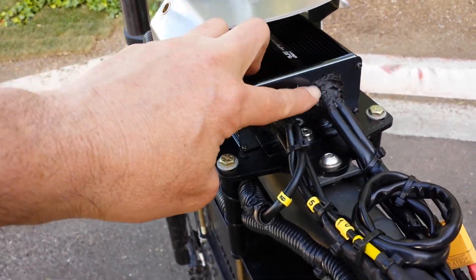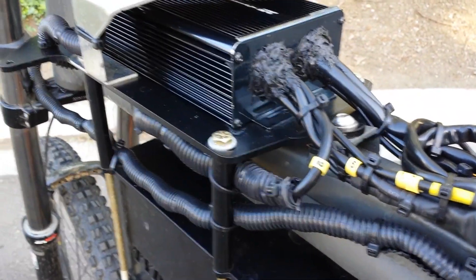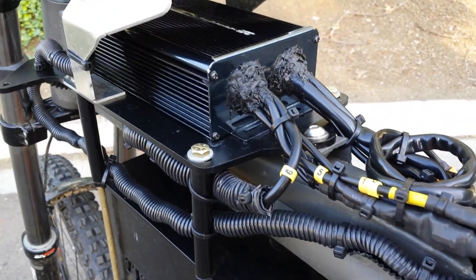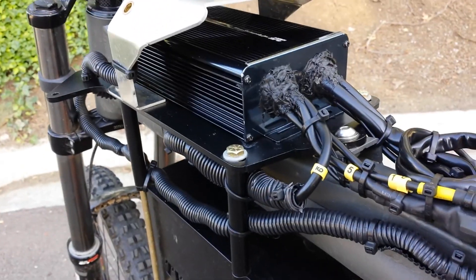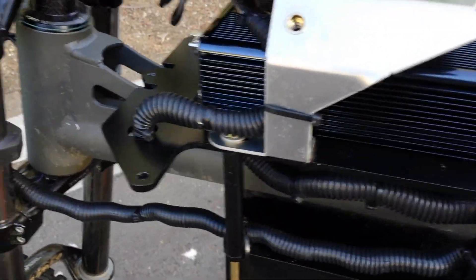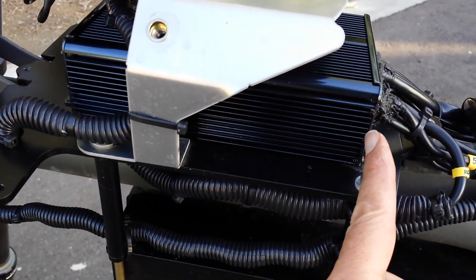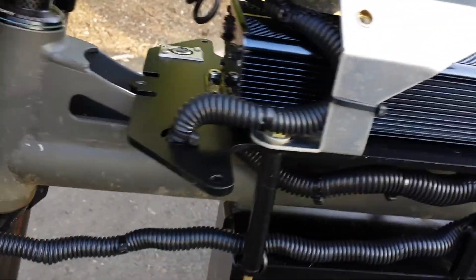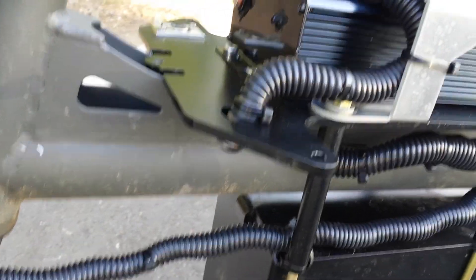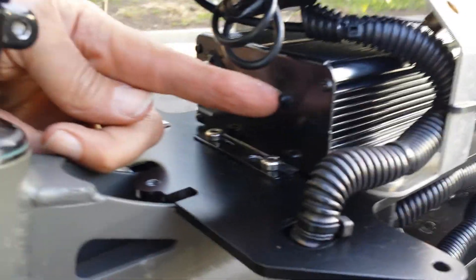You can see here I built up quite a bit of silicone seal. It did have seal there before, but it wasn't really as sturdy. I also sealed the end covers of the controller at the end planes in order to keep water out, and I put silicone around the power switch and the LED right here.